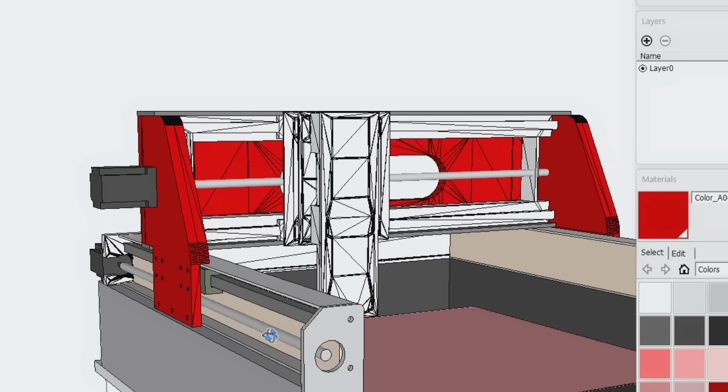And okay, with that shortened span that the gantry side has, also the gantry links both sides. Okay, you got the y-axis here, y-axis there. What bridges between them and is solidly connected through those linear bearings is the gantry. So if one side is trying to move, it's pulling the other side with it. And that doubles the stiffness right there, because you're not just relying on one upright on one side, it's actually connected to the upright on the other side as well. Anyway, that's all I have to say about that.